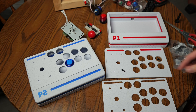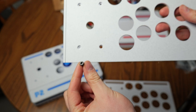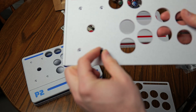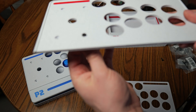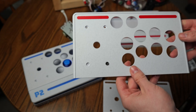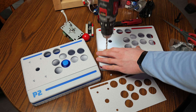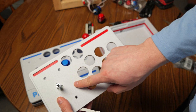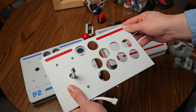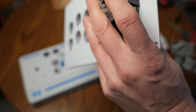Have you ever wanted to build your own fight stick? This is my DIY guide. I had to drill a hole out because the design called for 3mm holes, but I could only find 4mm ones at the local hardware store. They're not as flush, but I think that's okay. We'll tighten that on with the nut and bolt and then put it in here. I did two of these differently — I ironed the top of one print and left the other with the build plate texture, and I actually prefer that build plate texture over the ironed top.